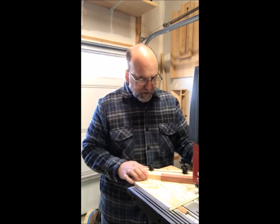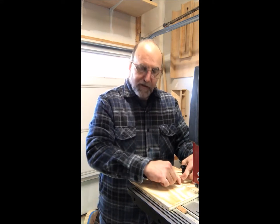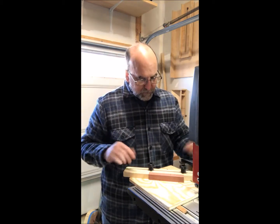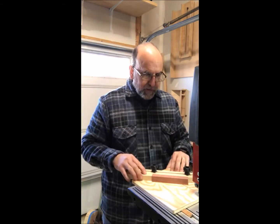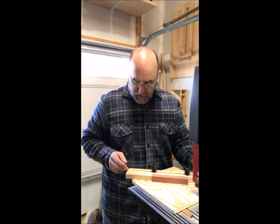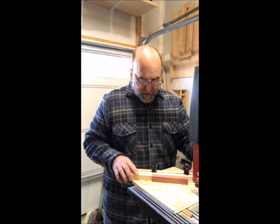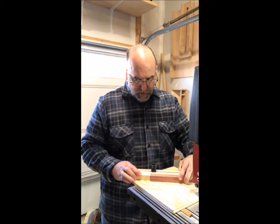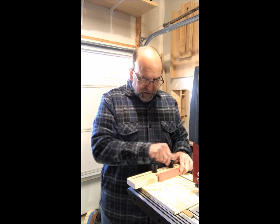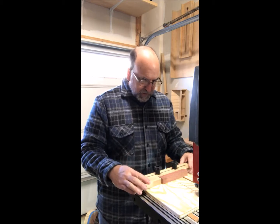I think this is the way that I would prefer to do it. Slide it down here, put that line right on my kerf line, and set it at a 45-degree angle, and then I'm ready to cut. Tighten it down and ready to go. So what I have now is a 13-inch arm and 11.5 inches. And the distance between the two hold down bolts here is 4 inches, 2 inches on either side of the kerf line. All right, and that seems to be a good distance.